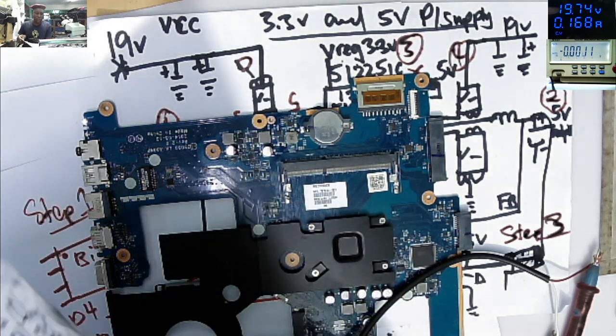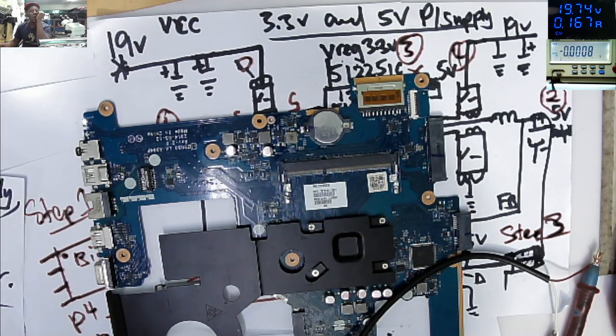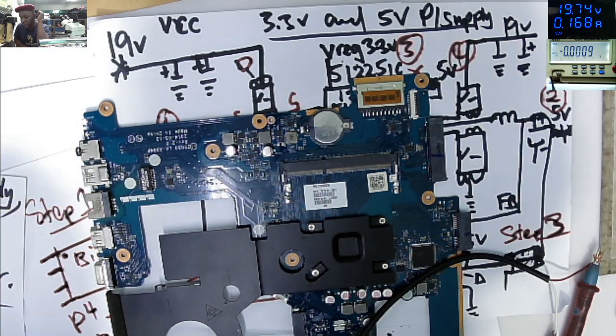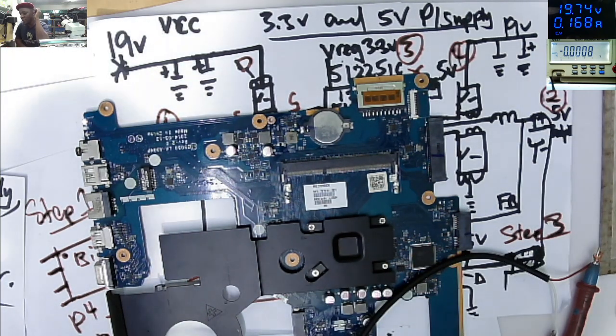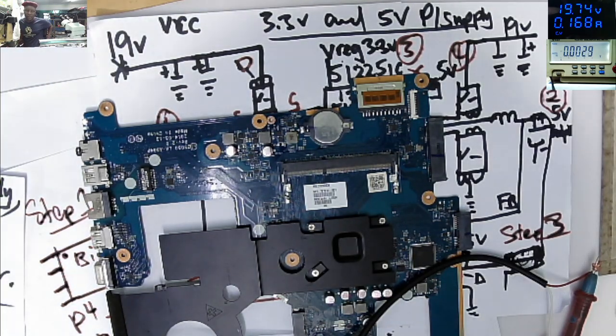And the BIOS chip, you know, the BIOS settings are kept on the BIOS chip, but in order for them to be alive, they use a BIOS battery. You see, this BIOS battery is also 3 volts. That's a 3 volts battery, the BIOS battery. And especially on these new models of laptops, I found you can get a corrupt BIOS, but a shorted BIOS chip, I never found any during my history of repairs. But a corrupt BIOS, yeah, the program on the BIOS chip can get corrupt.